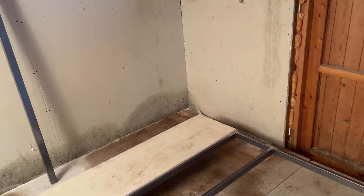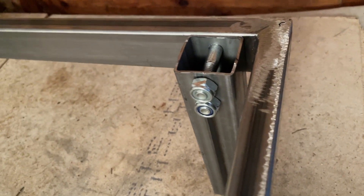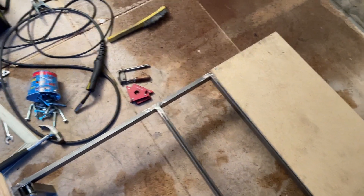I've been here for about an hour already. You can see I have the legs installed — they are bolted in with two M10 bolts and lock nuts on each of the four corners, and it's really sturdy. I don't think it flexes at all. The welds held my weight, and obviously the force will be even more distributed in normal use. It's insanely cool seeing this actually come together.